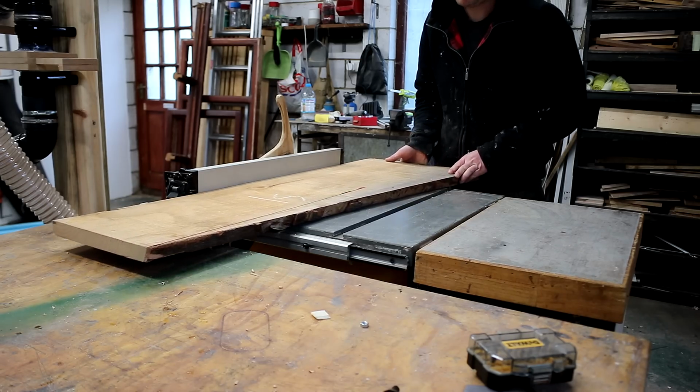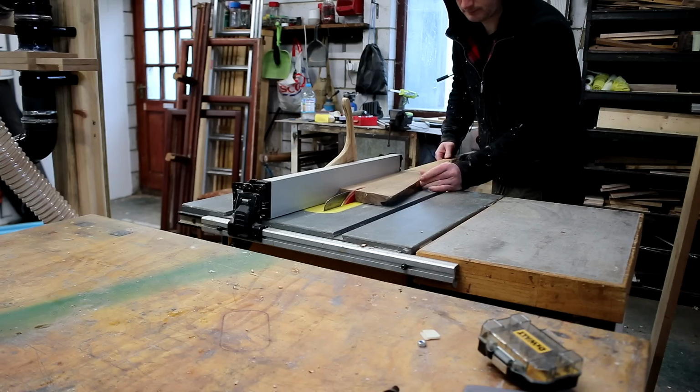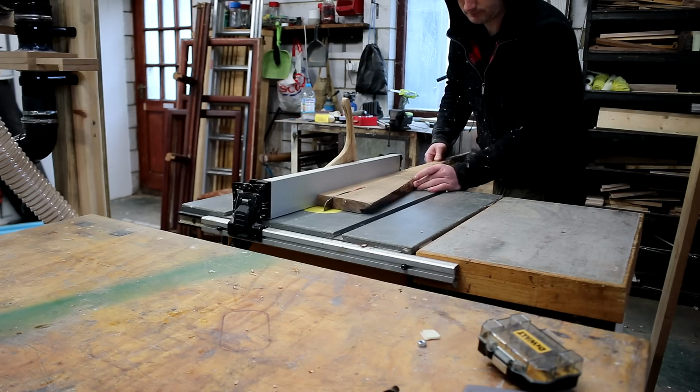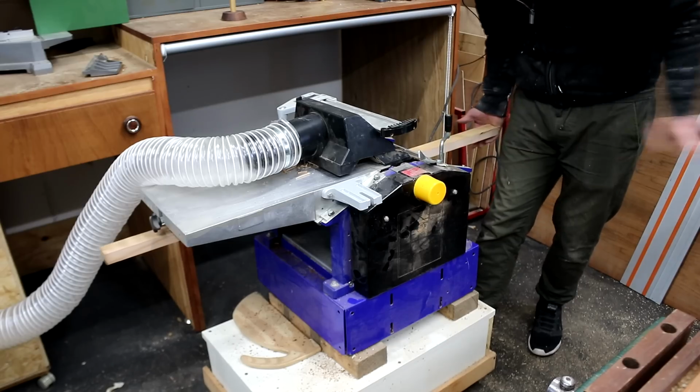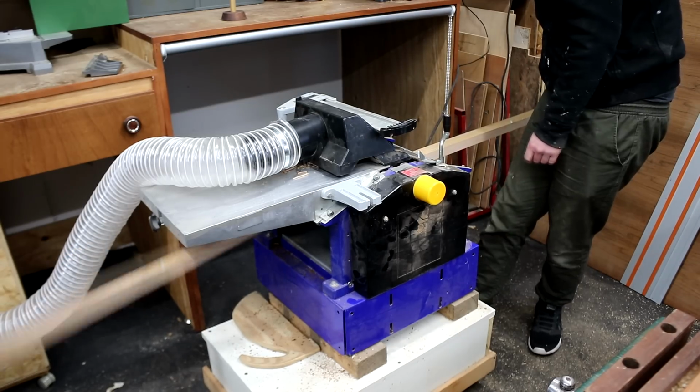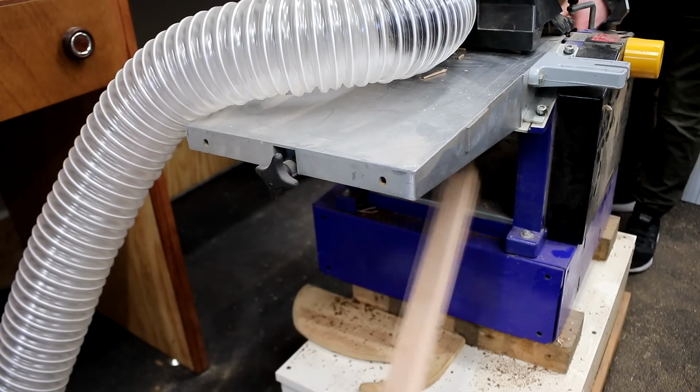Like most projects, this one began at the table saw. First I ripped a straight edge onto it and then I cut 4 pieces for what would make up the legs of the frame of the baby gym. I ran those through the thickness planer to clean up the grain. I didn't need to surface plane these first because the wood was good and straight enough already for how I'm going to be using it, and here's how they looked all cleaned up.